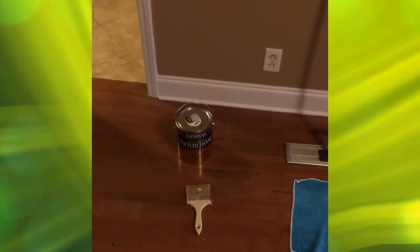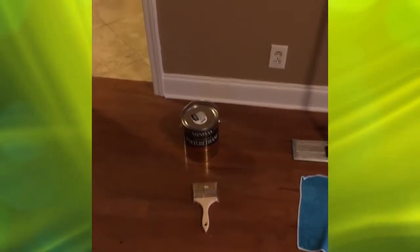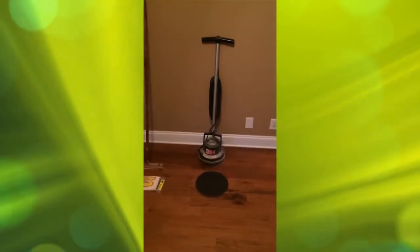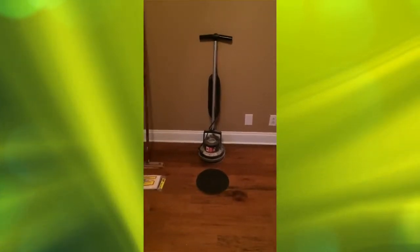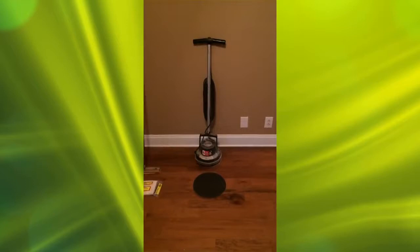That short brush is a lot easier to store for the next time you want to use it or if you have a missed spot. We also like to have a set of rubber gloves around. Now, if you really want to DIY it without the floor buffer, you can simply get a drywall pole with a sanding screen and do it by hand. We use a 100 grit sanding screen, and that's really what I recommend for this task.